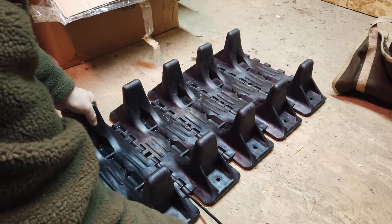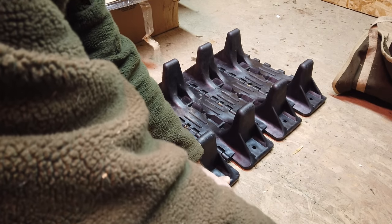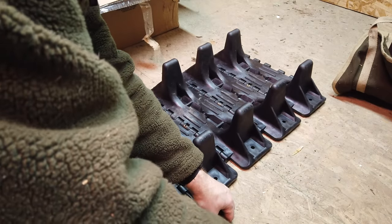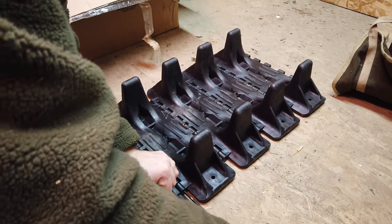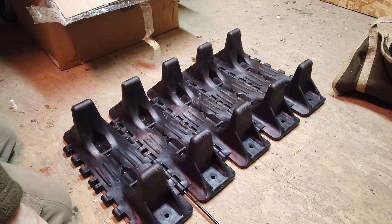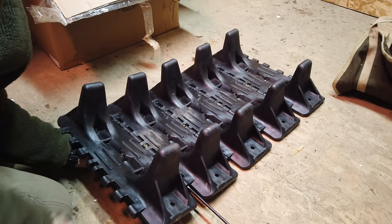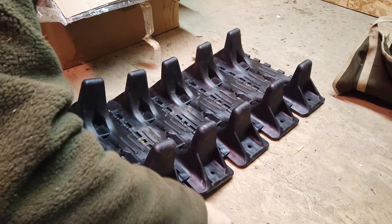The tracks are assembled segment by segment, with the pin driven between the two segments to hold them together. In the centre is a bushing that locks the pin in place, and is held solid with the set screw. There are 31 segments per side, with one spacer. After you've done the first couple, it's pretty much rinse and repeat.